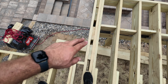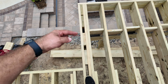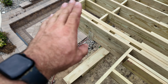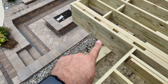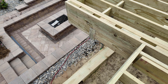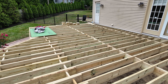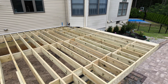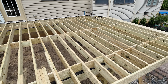This section looks a little funky, but the way we frame for stairs is: there are four boards that go vertical. The reason is we have double blocking there, and when our stairs come up, the last step is the deck itself — you step off and drop down about seven inches. So when we do our stringers for the stairs, we need something to attach them to. There's the drop beam in the middle, reinforced with GRKs, which is why this area is all beefed up. And that's basically how we frame a deck. I hope you enjoyed this video — be sure to like and subscribe. If you have any questions, feel free to leave a comment, and stay tuned for when we start putting the deck boards on.